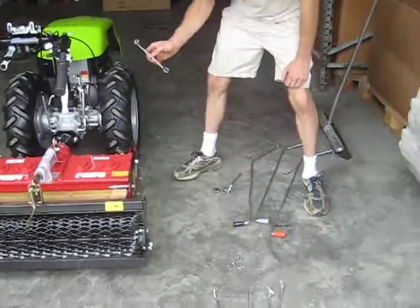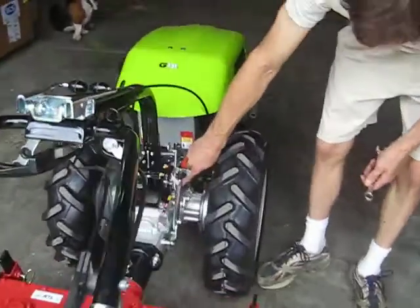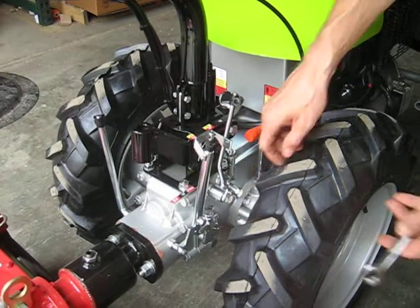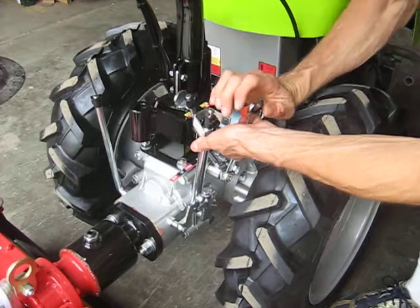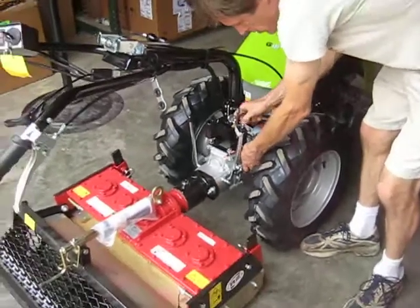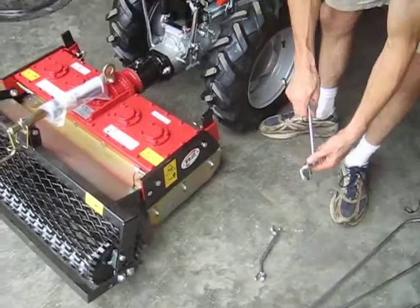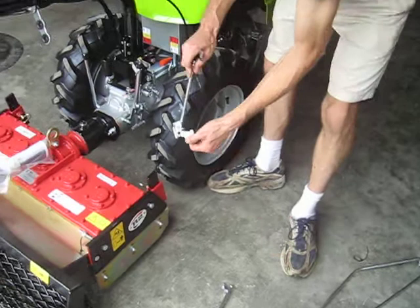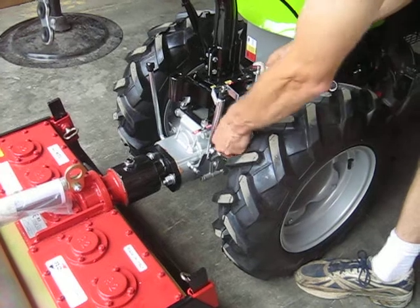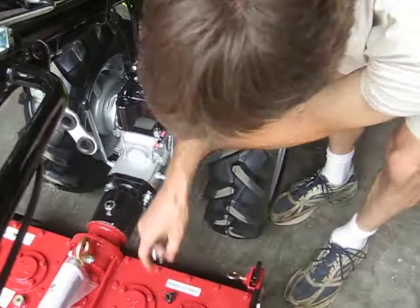So, during this change, we also need one tool, a 17mm wrench, which is used to change this shift lever right here. This is the gear shift selector, gear speed selector, held in place by one 17mm bolt. So now, we remove. This is the one that comes with the gear shift for front-PTO work. Side.